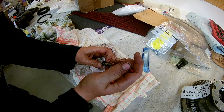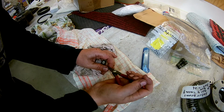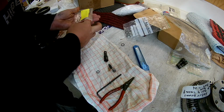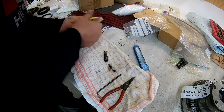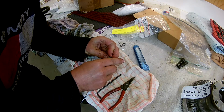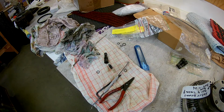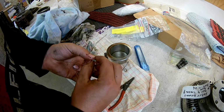And as I had replaced a couple earlier, I had brought them to a place that sells O-rings and just purchased some new O-rings for them, and support rings. The support rings that I ended up buying, I didn't really like the fit of that, so I ended up reusing the old support ring for one of the O-rings there. So there are 3 O-rings needing to be replaced. One is on the adjuster itself, and trying to get that off, it actually broke. I would say that's a sign that it's old and brittle and maybe not sealing. I think this one is the cause of the leak.